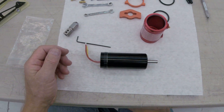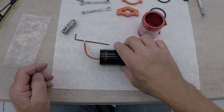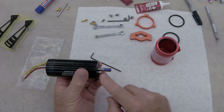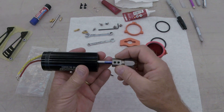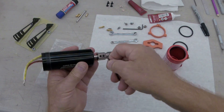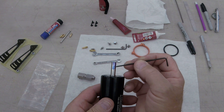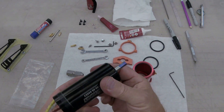Okay, let's see if we can wrap our project up. Most of our stuff is done, our motor mount is done. We don't have the motor ready yet though. Here's what we're gonna do - we need to mount our collet. Of course they don't provide flat spots, so I colored this a little bit and while it was still assembled I put it on here where I wanted it, tightened the screws a couple times and pulled it off. Where I put a little bit of that bluing compound, I can see where those screws were hitting - and that's where I want them.